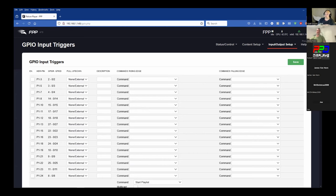There are two RJ45 ports on the extender node, not one. The idea is you could have multiple podiums — either two podiums of six buttons doing the same thing at different locations operating on a bus, or one podium with three buttons and another podium across the yard with three separate buttons. You can daisy-chain the extender nodes to split those six input triggers to multiple places.